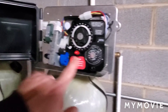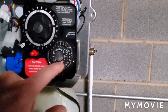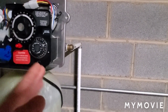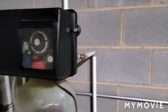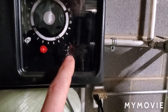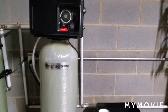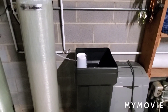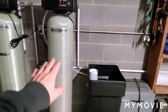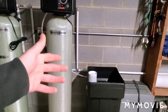This unit here is actually a metered unit, so it works off gallon capacity — you set it for however many hundreds or thousands of gallons between cleanings. The easier setups you'll find online are a digital timer head, which works just like a clock — you pick the pins for how many days you want it to clean. But this isn't really a video on how to install it; it's about understanding how they work.